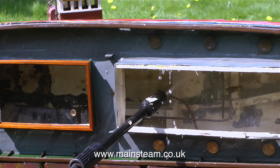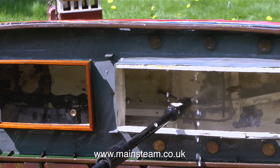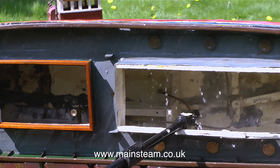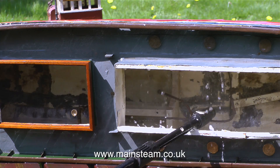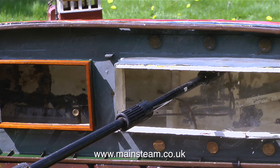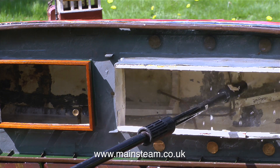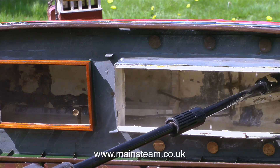As you can see from this clip, quite a lot of the paint is just falling off the inside of the hull with a bit of help from my small pressure washer on full power. By keeping the pressure washer very close to the inside of the hull, the water blast removes only paint that's not firmly stuck — if the paint isn't removed by the pressure blast then it's stuck to the hull and it's going to be okay. The steel plates this boat is made from are tinned steel, and I was told by the son of the man who built it that the metal for the plates was cut out of baked bean tins — lots of them.